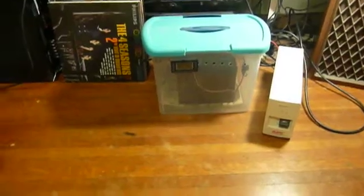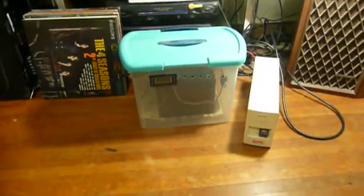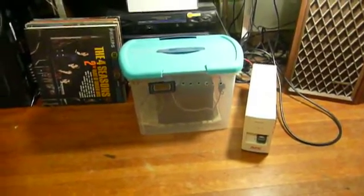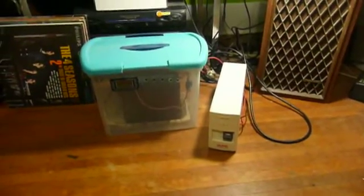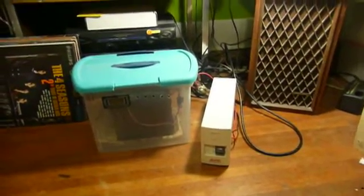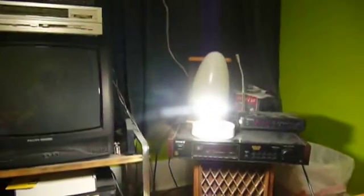There's a little switch on the side to turn that off when it's not needed. Basically, when this thing needs to go to battery, it'll switch over and carry a load in the face of a power outage. What I had initially planned to do was build a backup lighting system for my basement using a contactor from a heating system that was normally closed — meaning as long as there was no power applied to it, the contacts stayed closed and allowed whatever was attached to them to operate. Whenever it was powered, they would stay open. That's perfect in a power outage: you lose power to the coil, it connects the load to the UPS, the UPS switches to its battery, and I was going to run a bunch of lights.